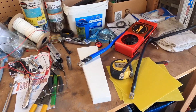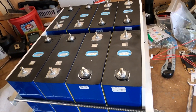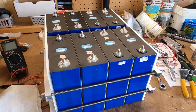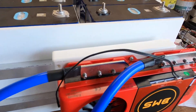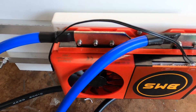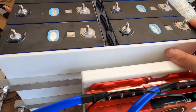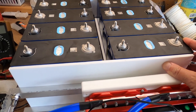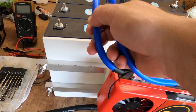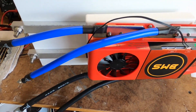Today I'm going to mount the BMS, probably on the side there somewhere, get everything connected and functional and then get this bad boy into the boat and connect it. I've made a little bracket here for the BMS — got one screw in it now just holding it in. This has four screws into the aluminum rails that are acting as the compression on the LiFePO4 batteries, so it should work out pretty well. These two wires will go up to the negative side of the battery, and these two will go to the negative side of the boat — that's how it'll work.